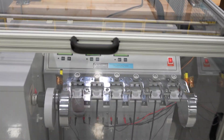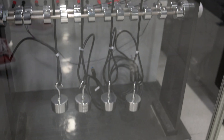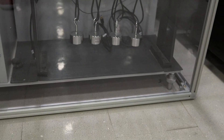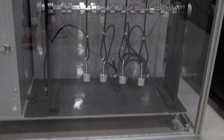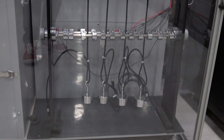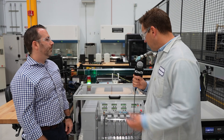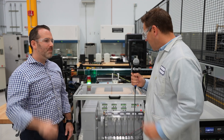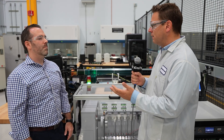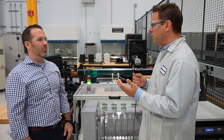Right here is our cable swing tester. It tests the strain relief boot on the end of each cable to make sure that after X number of cycles — depending on the use case — the strain relief won't break and there won't be any broken conductors inside the cable. You see the kind of frayed ends on old cables where the boot's gone and it's cut through. That's going to be the killer to the whole system. You can have the best system in the world, but it can be let down by a poor quality, low-cost cable.